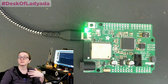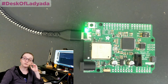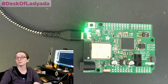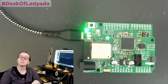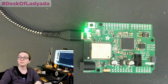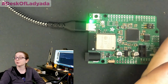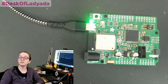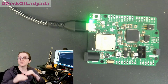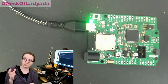And hopefully we'll get some of the support for the really cool advanced peripherals that come with those. There's a TFT, there's cameras. These have high-speed USB, which is really sweet. We can start doing high-speed USB stuff like audio and video within CircuitPython. So this is going to be a very interesting family of chips from NXP that we're going to be exploring. Starting with the RT1011, we're going to start small and then build our way up until we get to the 1060 or the 1070. Once you get to the 1070, it's basically like a Raspberry Pi Zero.